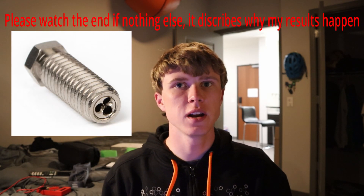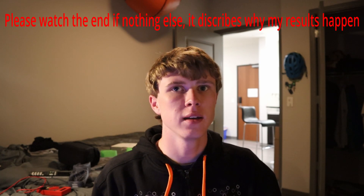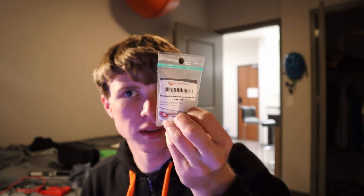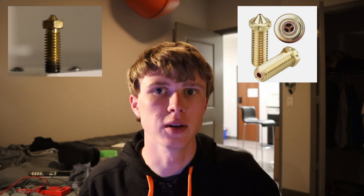This is my video on whether CHT nozzles really work. I bought a normal 0.6 Volcano nozzle, a 0.4 genuine Bondtech CHT nozzle, and two knockoff CHT Volcano nozzles that are 0.6 millimeters off AliExpress, and I tested all of them with different materials to see which performs best. I won't show testing for the knockoff CHT nozzle because I saw zero difference between it and a normal nozzle with the same diameter — knockoff CHT nozzles don't really work, and mine just caused more clogging.